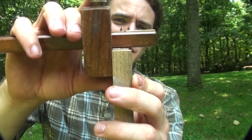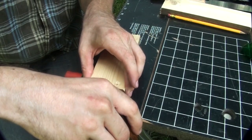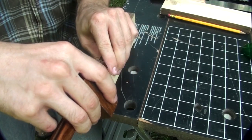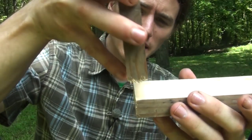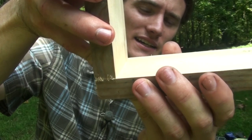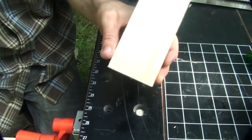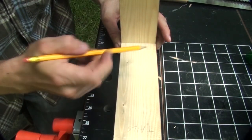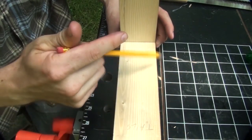I've set the marking gauge to the thickness and all I do is scribe the line. If you don't have a marking gauge, another way is to take your opposite board, set it perpendicular to your board just as the joint's going to go, and then take a pencil and mark across the back side. The easiest way is to set one board vertically on your work surface, slide the other piece right up against it, draw a line, then flip the board and do the same to the opposite side.